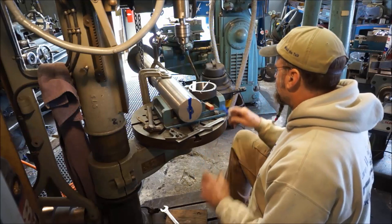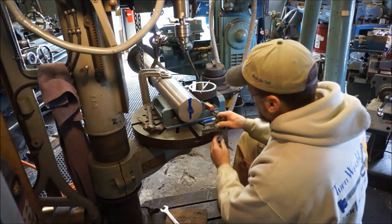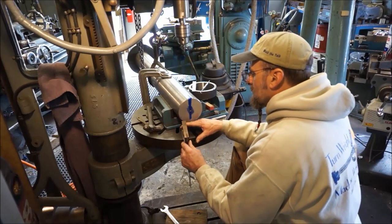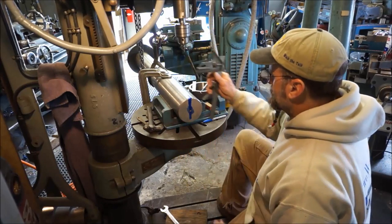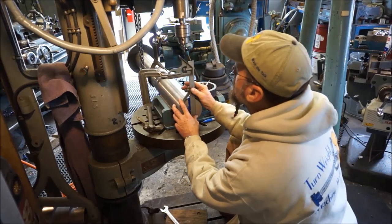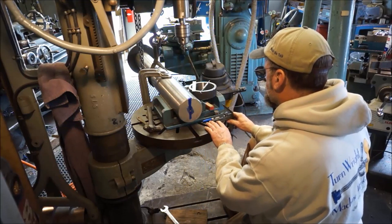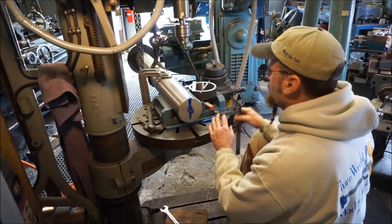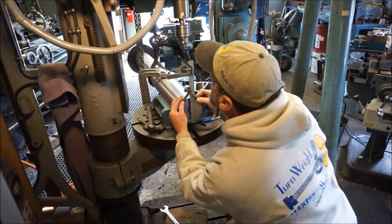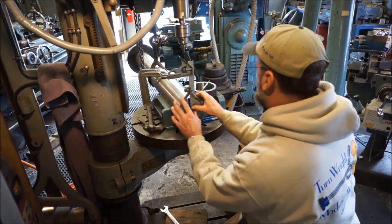All right. Now, my drill press here, fairly level. I'm going to run my center finder like this, and I'm going to look at the bubble. And actually, we're going to be working in this direction right here. It's pretty close. It's about a 1/16 of an inch inside the bubble. I like that.